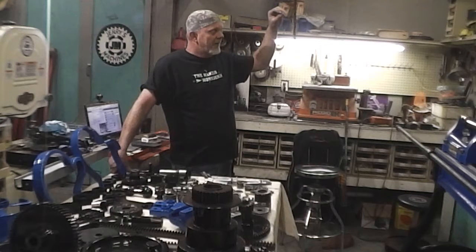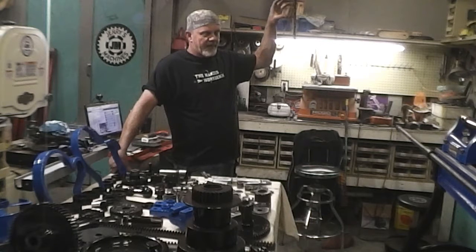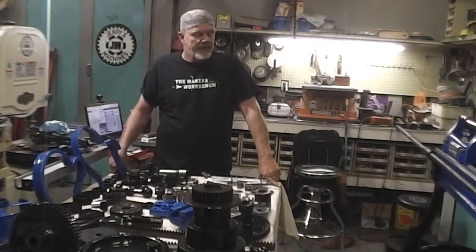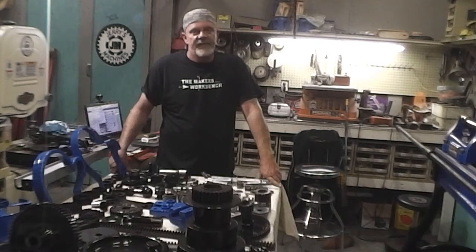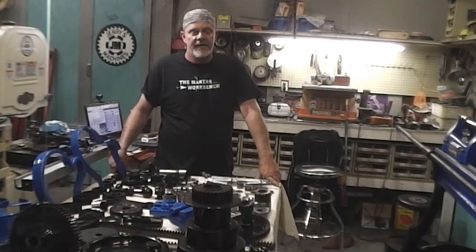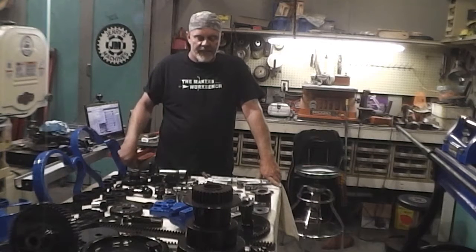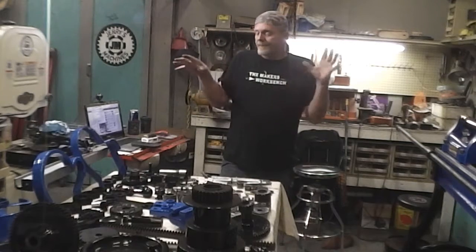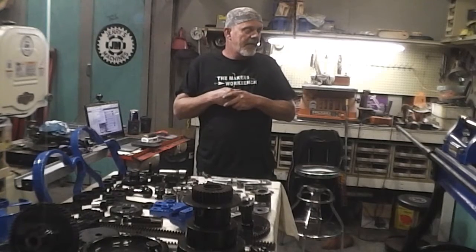Although I really doubt that that secondary drum drive and a 5 horsepower motor up on top of that thing is going to even remotely make this thing unstable. So that may end up being the way that I have to go for practicality reasons, but we'll just have to see what happens. For now, my goal is to try to get it underneath, so I'll get my belt on that drum when I put that together, and I'll drop it down through the bottom, and if it doesn't work, then I'll just have to thread it up through the top. Anyway, I'll quit babbling now, and we'll get to putting this power feed together.